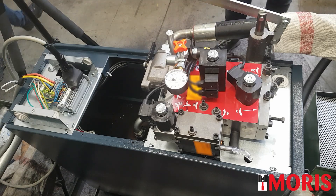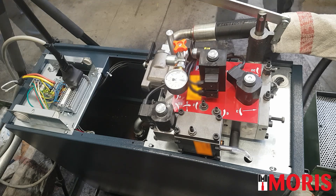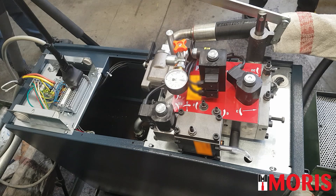Please check the test report document inside the power unit. Verify the positioning of the deceleration magnets with the help of the measurements indicated on the test report. These measurements are indicated as X2, XP1, Y2, YP0. Check the measure of regulation number 4.